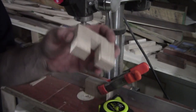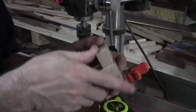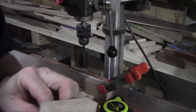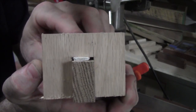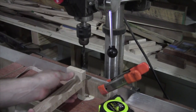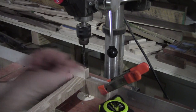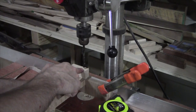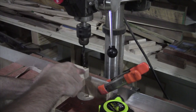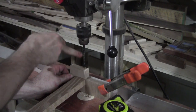For the tail block or the head block and the handle, I want the handle flush with the back side that's going to be up against the fence and flush out here. I just took a piece of paper and folded it up so it would fit in there and when it's spaced, that gives me a nice flush line. I push this up against the fence, reset my stop block. My hand is pushing up against that stop block and I've got my drill bit centered. The fence position is still the same from the last drilling. We are set back from this front edge 7/16 of an inch, and then centered at 3/8 of an inch — that's where we're going to be drilling.